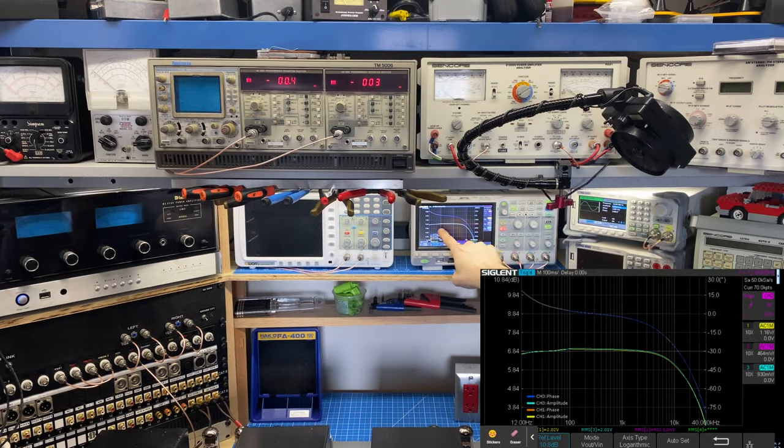If we look right at this line, this is 6.84. That's just my reference. So if we think about that as 0 dB, we can see how closely this amplifier tracks to that frequency response, and it doesn't start dipping till around maybe 6 kilohertz, and then at 10K, 12K, we're at negative 1 dB, and negative 3 dB is all the way down here, past about 35 kilohertz. So overall, the frequency response in these is great. It may actually be a little bit flatter than this. Not all my parameters are under control here as far as impedance matching and things like that. But what I can say is that these things are tracking extremely close to one another for both phase and frequency. That's what we're looking for working on a mono block pair. So I'm really happy with how these came out.